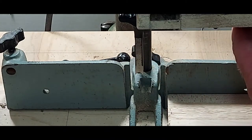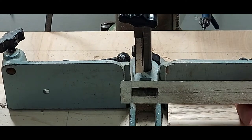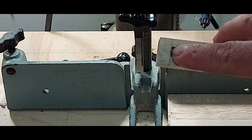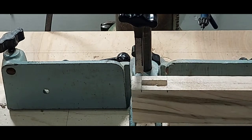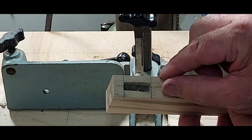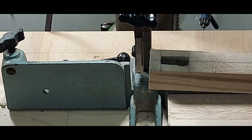Alright, we've got a hole now. I was going a bit quick and should have been cleaning it out, so it nicked the edge a little bit — but that's okay, because typically after I do this I'll take a sharp chisel and clean it up. The edges are a little rough and that's not unusual, so you just account for that. Now I've got a tenon already cut, so I'll check and make sure that it's close. I usually make tenons a little bit big so I have room for adjustment — I can clean off both sides after the mortise is cleaned up.